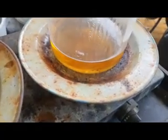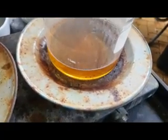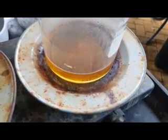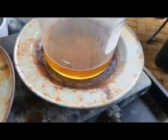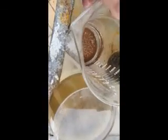Okay, now the boil's finished. Let it cool down. To pour it out, I save my HCl, so I'll put that in the bottle. And then three more water washes. When I tipped out the hydrochloric acid and put some water in there, I thought the film was recording, but it wasn't. But as you can see, there's not much gold. There's a little bit, but there's not much. Not as much as you would expect from all those boards. Hence why I said you need so much computer scrap to get anywhere. But anyway, I'll drain this off and I'll put two more water washes.